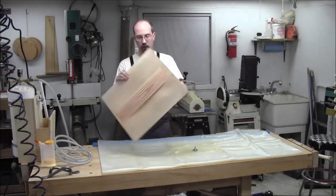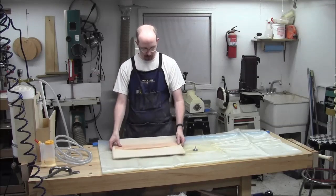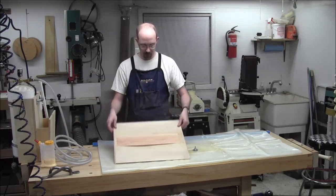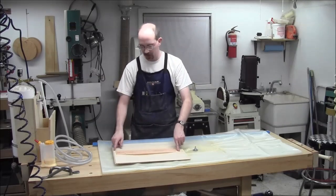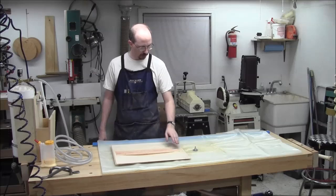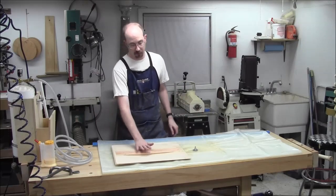The next challenge I've got is figuring out how to hold on to this thing supported so it doesn't wobble around while I try to plane. I'm going to try to use a hand plane on that, I think. The hand plane is the best way to go there, and just smooth this out. Basically, I'm tapering to 0 out here is what I'm after. So that is reasonably good so far. The next bit is we've got to get that center block, we've got to work hold first.